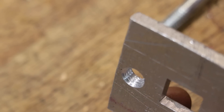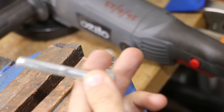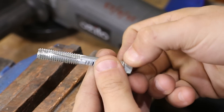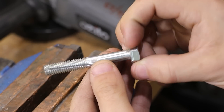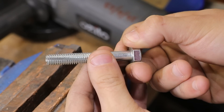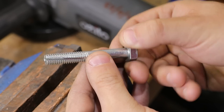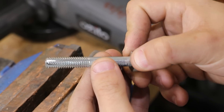The cutting force is also quite high and it seems to be binding up a fair amount in the hole. I'd also be willing to bet that if you hardened this, you probably wouldn't get too far trying to tap steel — you might get somewhere, but I'm sure that thread wouldn't look all that great. All of this is to say that there are a few things you need to consider in order to make a good cutting tap. End of the day, it still is a cutting tool, and you need to consider all of the cutting geometry.